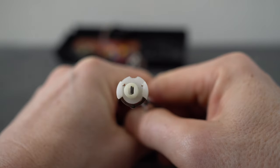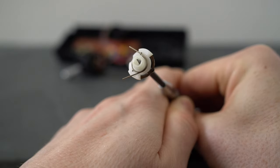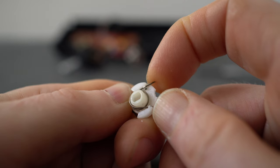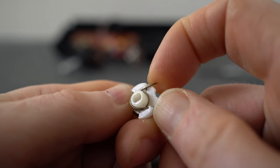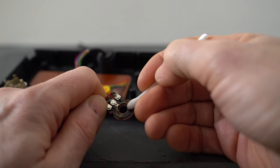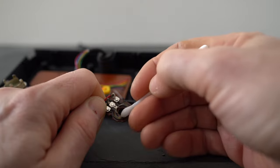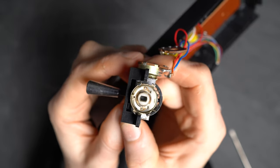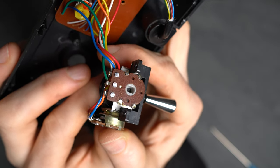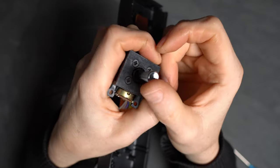Turn the plastic part around and you'll see how the spring clips into it. First, rest the circular part of the spring over the central part, then squeeze the legs together until you can push them below the two small tabs. The legs should now be pointing up towards the small semi-circular notch on the plastic nut. With the potentiometer disassembled, take the opportunity to wipe the metal contacts with some clean alcohol on a cotton wool bud or Q-tip. Then put it all back together by sliding the plastic nut back over the axle with the spring side going in first, push the brown board back under those metal tabs ensuring the wiring is on the correct side, and push those tabs back down. That's one axis fixed and good to go.